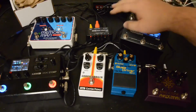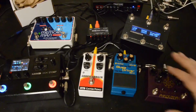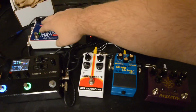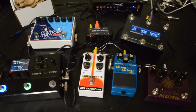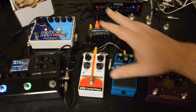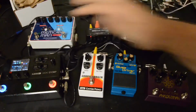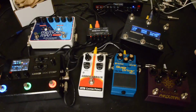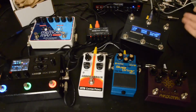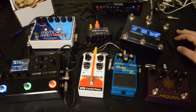So in this scenario, we've got ports 1, 2, 3, and 4 running these 4 pedals, and port 6 here is plugged into the tap of the Deluxe Memory Man, and none of these pedals are aware of the other pedals in terms of these remote circuits or the sleeve of this tap touching one another. And so that may or may not be an issue in your rig, but it certainly could be, and so we wanted to make sure that it never would be in practice.